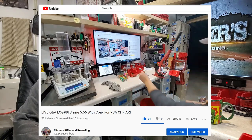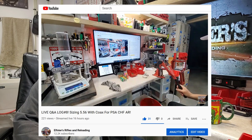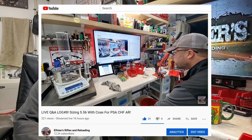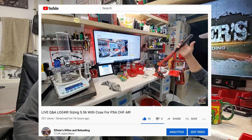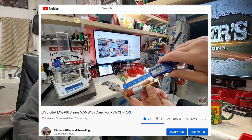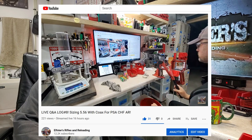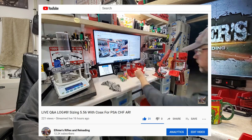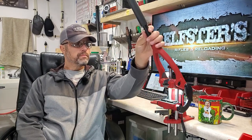To get consistent headspace bumps regardless of the press, you've got to run that press handle consistently — that goes for anything. The measurements are coming in at 4.525 consistently, with nearly every single reading at 4.525, and one at 4.52. I cannot tell the difference between the two — they're both insanely consistent in regards to headspace bumps and seating those bullets. In my opinion, it is a must-have mod.